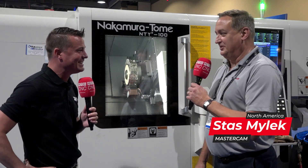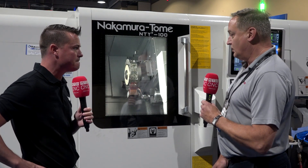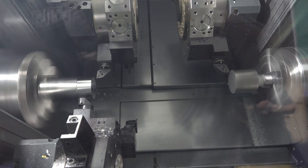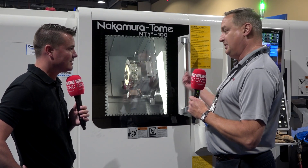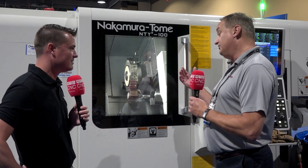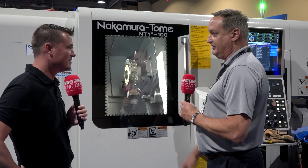So Stash, thank you so much for being a part of MTD. Let's talk about this part and what you guys are doing on this Nakamura machine. We have a demo part here and we designed this part to take full advantage of all the capabilities of the Nakamura. It has a triple turret, so we're able to do simultaneous operations on the main spindle and at the same time we're running operations on the sub-spindle. We're trying to maximize as much productivity on the machine as possible, cutting down cycle time if you're running production parts. We've got some threaded features, some features that allow us to do both pinch and balance turning, and we also have simultaneous milling operations — a peel mill on both the top and bottom turret. It's a really cool machine that shows the full capabilities of the Nakamura.